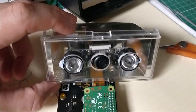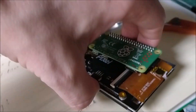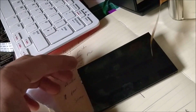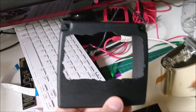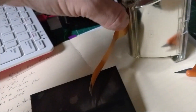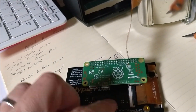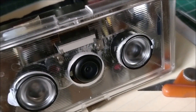The next stage of the night vision hack is to mount the camera inside the flash surround. This is then attached to the Pimoroni Hyperpixel. I've had to rotate the screen — not physically, but the actual driver software — to ensure the image is up the right way, because otherwise when it fits in here it's upside down. I've done a few tests and it seems to be working. The problem now is this bit gets caught on the base, so I need to remove some of this or tidy it up. I might use some Sugru.